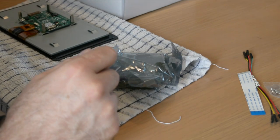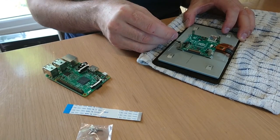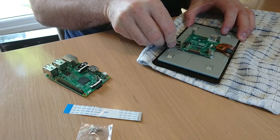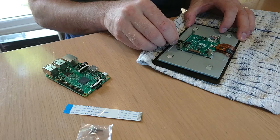You'll need to ensure that the orange ribbon cables are slotted into the correct ports if this is not the case. Next we need to connect the four jumper leads to the four pins on the side of the display board. Your wires may differ, but try to match them to the appropriate function, such as red to the 5-volt pin.